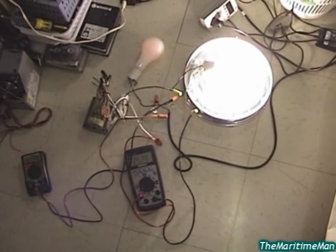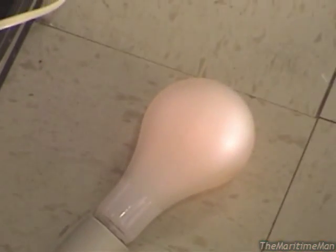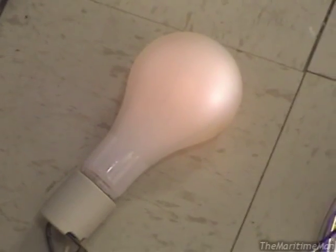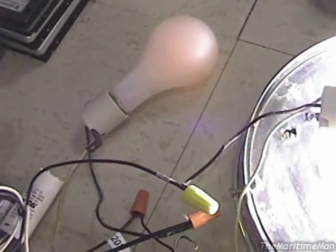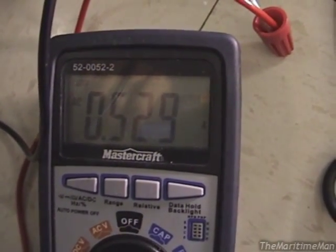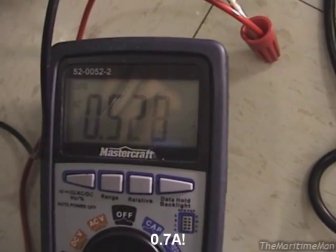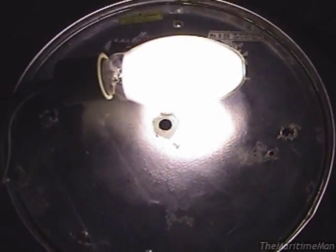So get a load of this — I found something that actually works really well. What you see right there is a 250 watt incandescent light bulb. I found that if I put this in series with the primary side of the ballast, so this bulb is between the outlet and the ballast, it reduces power to the ballast enough such that the current going to the mercury vapor bulb is now down from about 0.65 or 0.66 amps down to 0.53 amps, which is absolutely perfect. So this bulb is now getting a perfect amount of power.